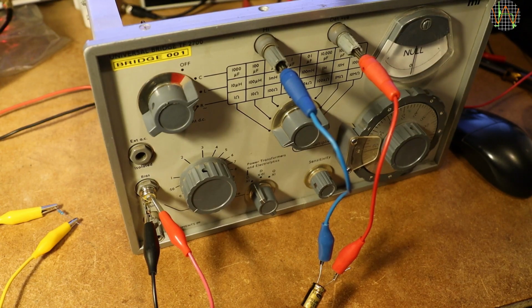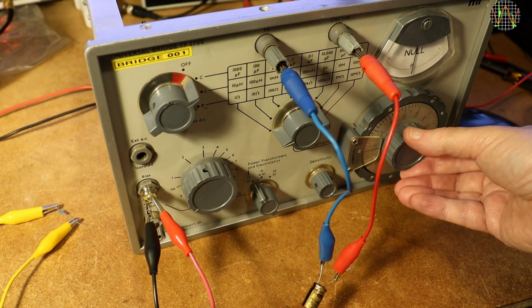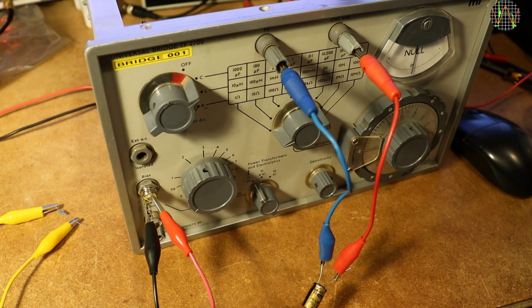In my test of the same electrolytic cap of 330 microfarad I used before, I did not see any difference in capacitance when biased by 9 volts DC, but then the manual says the effect may take a long time to manifest itself. I will try that another day.